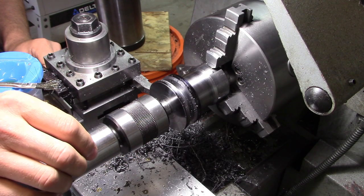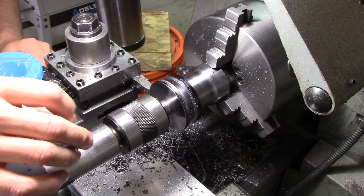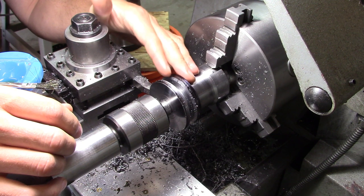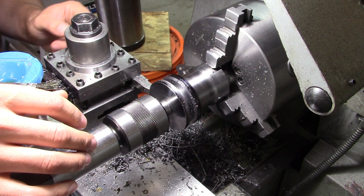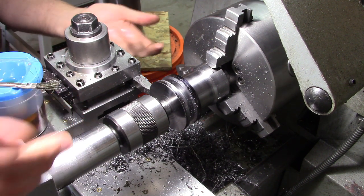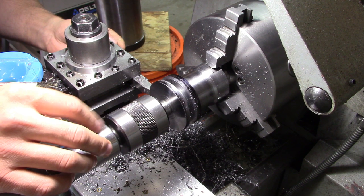A lot of you are probably wondering why I didn't do this in the same manner that Mr. Pete did. A couple of reasons — actually three. I have this form tool from making a few other pulleys before, since I've made B pulleys before. Also, I'm trying to use up some scrap, and I'm so close to the chuck that I'm kind of iffy about trying to get this thing set up angle-wise as far as using the compound. And I don't have a mandrel — Mr. Pete used a mandrel, so he could take it and flip it over with the compound set. I've made pulleys this way before; it takes a little longer, but it does work. And that's why.